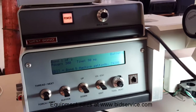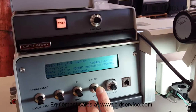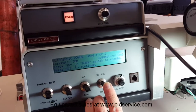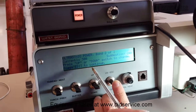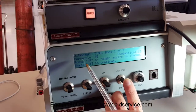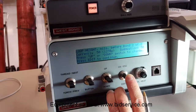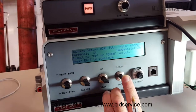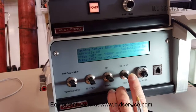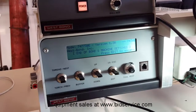Right now I'm using buffer one — we'll just step through that real quick by hitting edit. We're going to do two bonds. Ultrasonic power for bond one is 300, and for bond two is 300. The time setting that works well with the current setup is 90 for both bonds. You also have a loop height setting, wire pull, wire tail, full force on all, and calibrate. This will all be explained in the manual on how to program your bond settings.